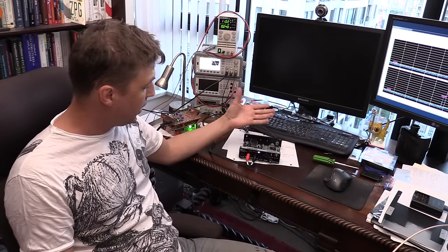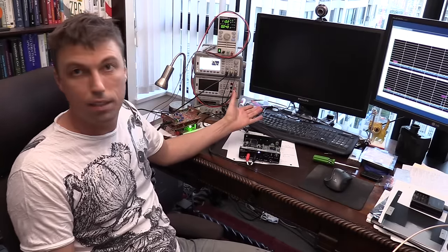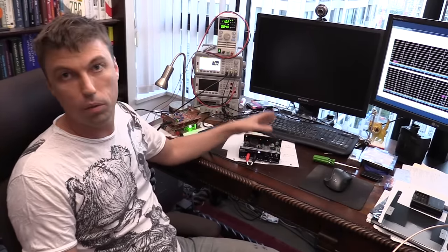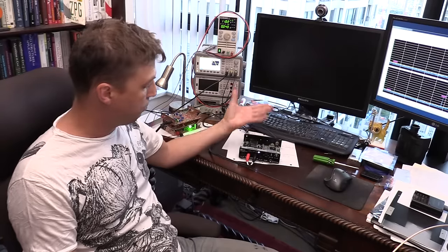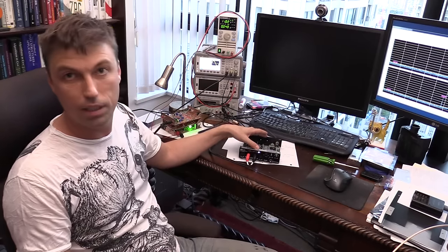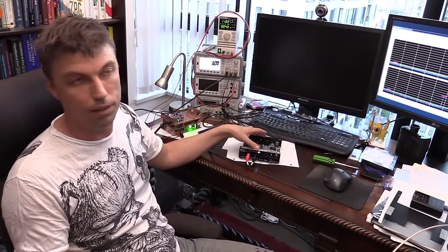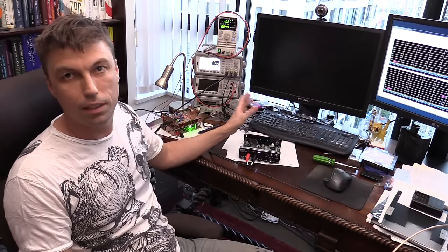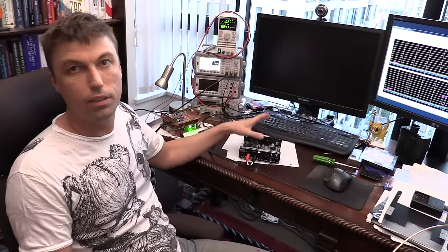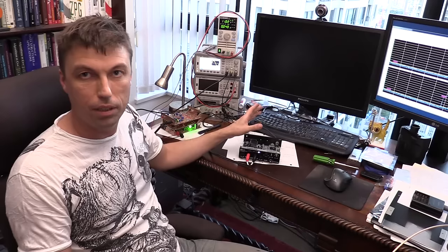So what's the conclusion on this? What I was actually looking for was something I can use as a sort of poor man's dynamic signal analyzer, where I can get myself a data acquisition board, one or two channels. Obviously stereo comes in two channels, but there is a problem with that, as you can see: using both channels might result in problems, because there is crosstalk inside this audio interface, and you can see that crosstalk is visible on any frequencies above, let's say, 40 kilohertz.